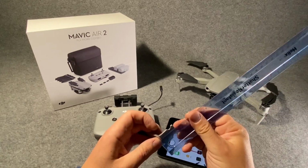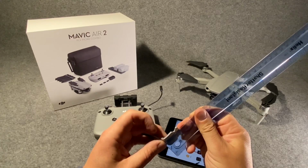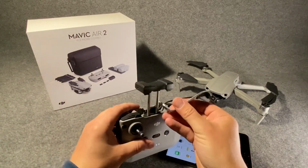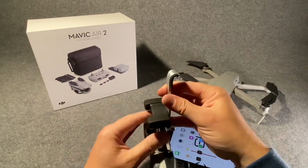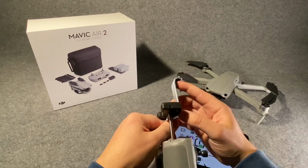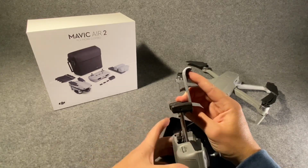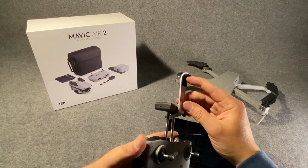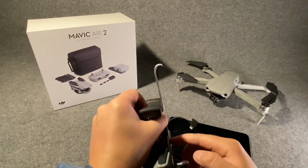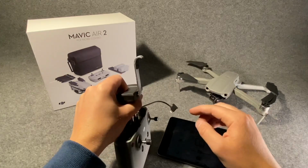It's about 27mm, I think, yeah, from the edge to the center of this first bend. That's probably the most important measurement in this. After that, then it doesn't really matter. So that allows you enough room for it to catch here on the bars, if you can see that. Catch there and still slip up past the front of this. It gives you just a nice profile for this.